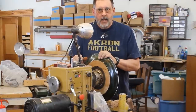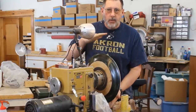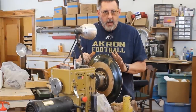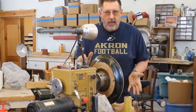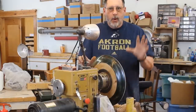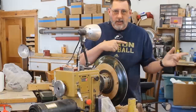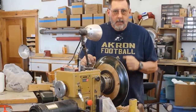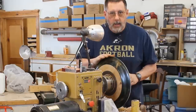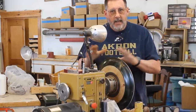You're looking at my Powermatic, and this is a project I've been working on. This Powermatic has a 20-inch swing, so I can turn a 20-inch bowl or a 20-inch platter. I very seldom use this lathe for long spindles — I'm not going to turn a cane on this. I bring the headstock up to the front part of the lathe and do a lot of hollowing without the tailstock. The tailstock is very heavy. This lathe is very powerful — I can do some heavy hollowing with it, so it fits a niche I need in my shop.